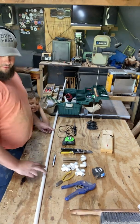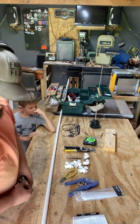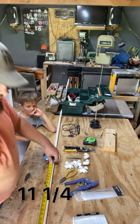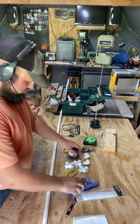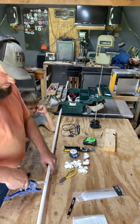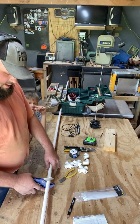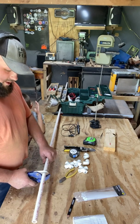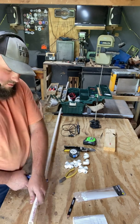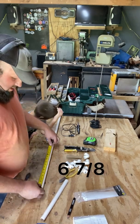I'm going to try to walk through it here a little bit. The first piece is going to be 11 and three quarters. I ain't got no hacksaw — I've got one of these old guys right here and they work really good, can bring anything up to inch and quarter pipe. First piece: six and seven eighths.